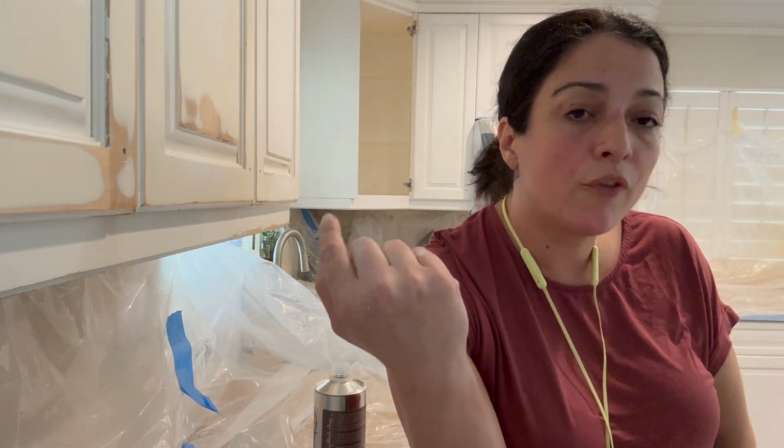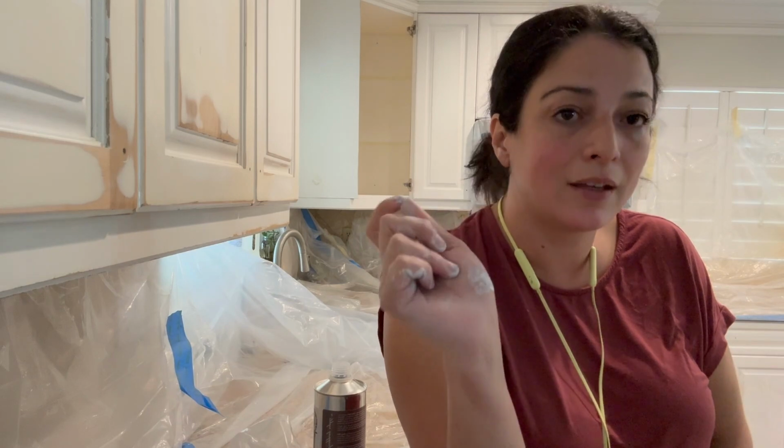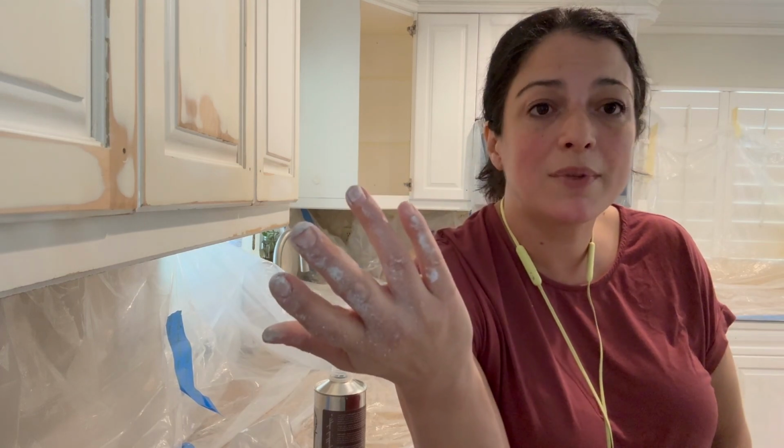If you're gonna spray them vertically, less is more, thin coats, nice, even thin coats. It's gonna be less work, less time consuming, less coming through and sanding. But if you make a mistake, no problem, just let it dry. It's nice and easy. Sand that out if there's any drips.